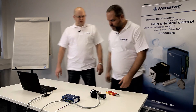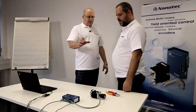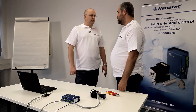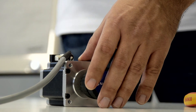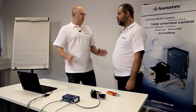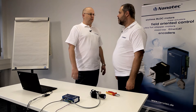Does the new sensorless encoder have other advantages? Yes. Basically, the sensorless encoder knows the exact position and speed of the rotor at all times. And therefore, the control of speed or positioning mode is much better. So that means I can use a stepping motor in closed-loop mode without an encoder? That's right. The system switches between closed and open-loop — low speeds and standstill in open-loop, and at high speeds you have the advantages of closed-loop.